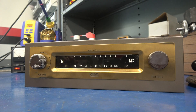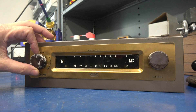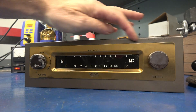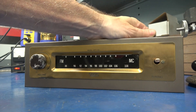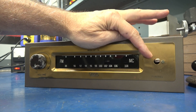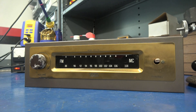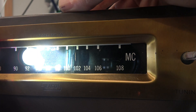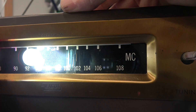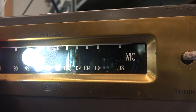Now we're entering the wiring stage. You're probably wondering what I'm going to do with this front panel. I'm going to maintain the volume with the on/off switch. The tuning knob will be the input — the shaft has already been disconnected internally. We're going to have the quarter-inch input jack there, and I'll add a treble and bass pot on either side of the ICO emblem. The ICO had this cool fluorescent tuning tube that showed the stations — I'm going to reuse that, so it will be illuminated just like it was back in the day.